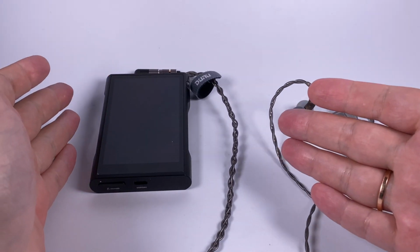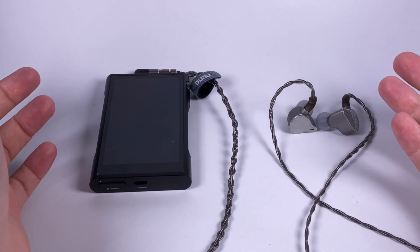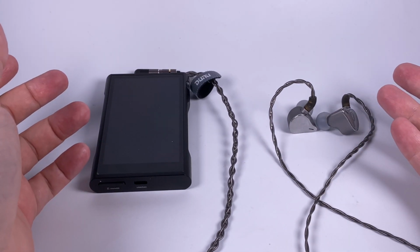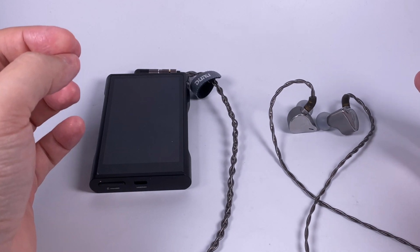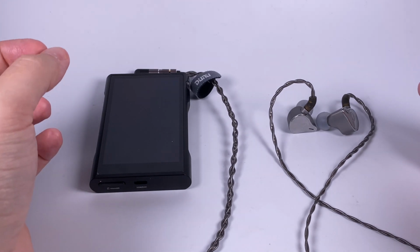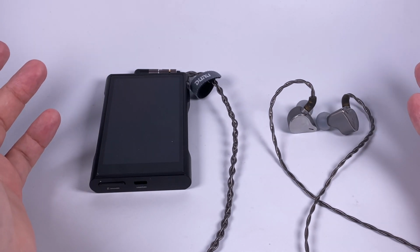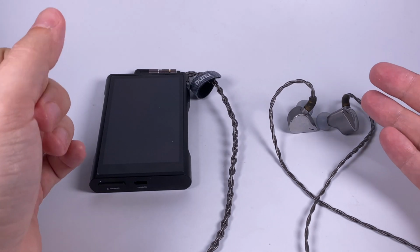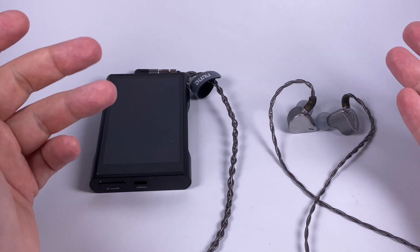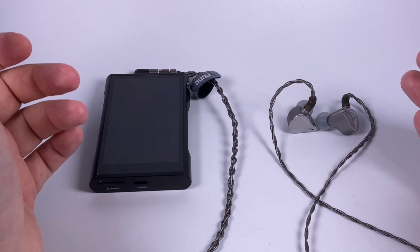And you know, first it's easy to think Shanling uses a system on chip here. It means that there are no op amps inside the audio circuit of this player, and what actually depends on Shanling, but they've implemented a few interesting things, and it's a good example of how small nuances can change the sound. So I'm pretty sure that many manufacturers in the nearest future will build their systems on that 9219 system on chip.